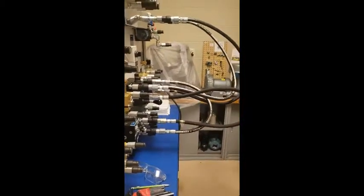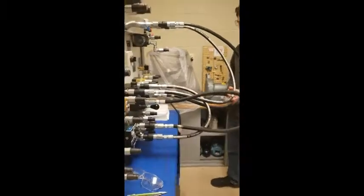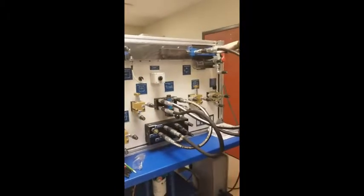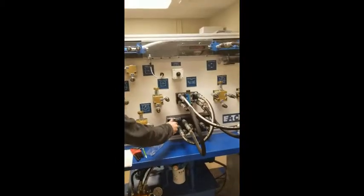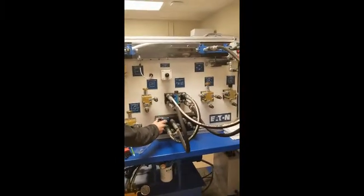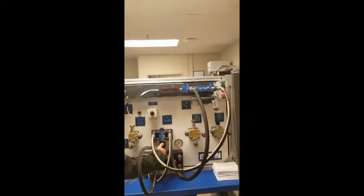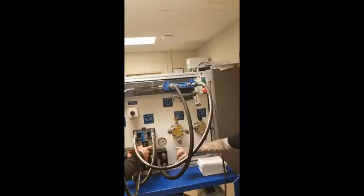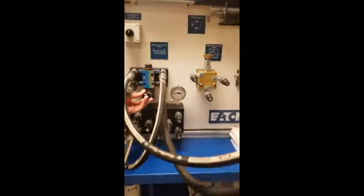Is your vent open over here? You can leave it open. We're going to turn it on — go ahead and start it up. Use the piston up there, close down the valve. This other line goes through the side and you can test it. The cylinder advances, and you can see here it's reading 200 psi, a little under, which is the setting of the valve right now.